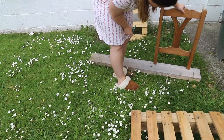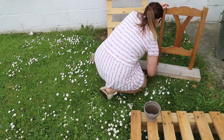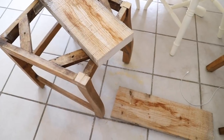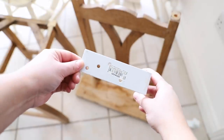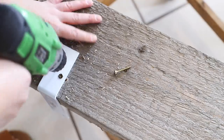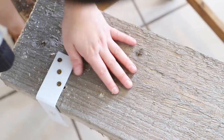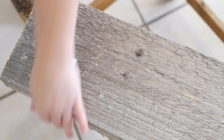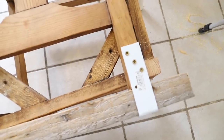I then went out to the garden to get some scrap wood I had left over from previous projects, because I'm going to turn the top into a shelf to hang on the garden wall. I roughly measured out a bottom for my shelf and cut it with the jigsaw. I used brackets to drill the chair to the base - that was sturdy enough to keep the two pieces together. Just drill a hole and pop in a screw. As the shelf is quite heavy, I went for a bracket because it's more secure than just drilling in screws. The bracket seems really secure, so I do recommend it.